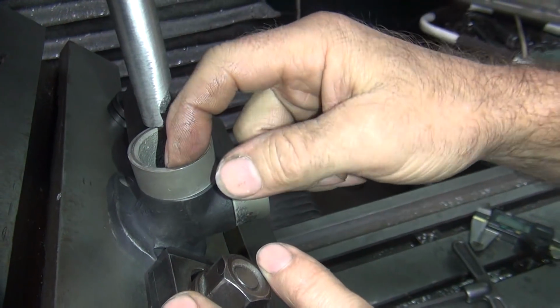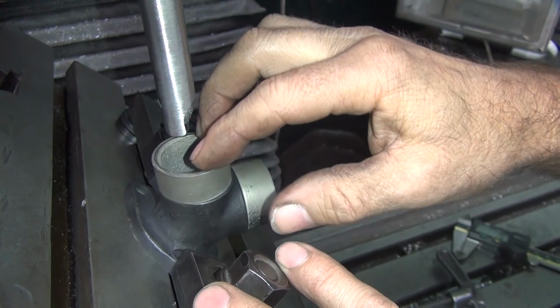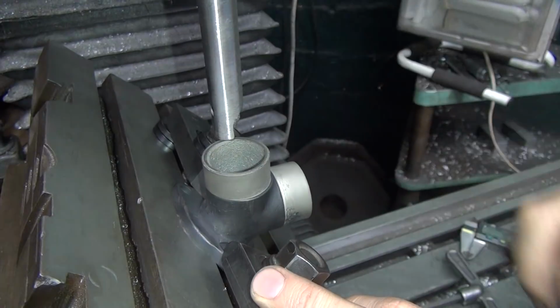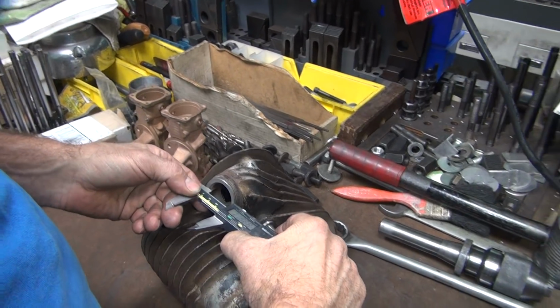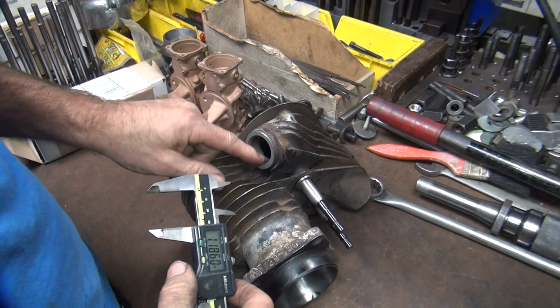So this is about 200 wide on the inside, on the tight area, 190, 180 width to 200 right in that area. They vary obviously, and we get that big chunk there where it's skipped in. Now over here in the port, here's your stock port. We're about 190 or so, 188. So we're right in that 190 area.